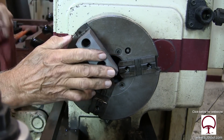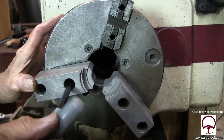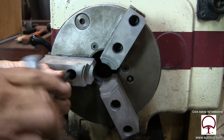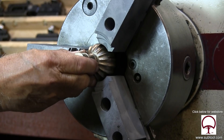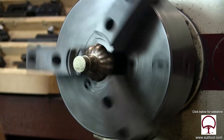The jaws are made specifically to go into a particular location. You can't just take any jaw and drop it any place, because of the way the scroll works. So here we are tightening it up, and I put a little pressure on it with a wrench. Right now we're putting our knob in there and getting a rough idea of what it looks like.